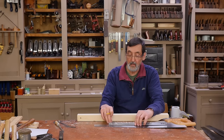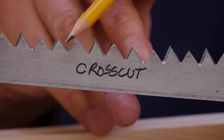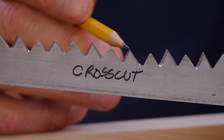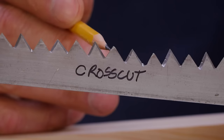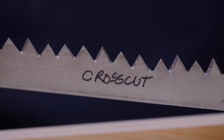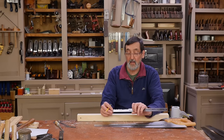When you look at the crosscut saw, you don't see anything on this side or this side, but when you come to the adjacent tooth you can see the side of one and then the other. Skip a tooth, go to the next — this means these teeth have been brought to a pinnacle point. These points are the actual cutting points rather than chiseled teeth, and that's the difference between crosscut teeth. When you view the teeth from the top you start to see how this dynamic works, and you'll learn it through the sharpening process.